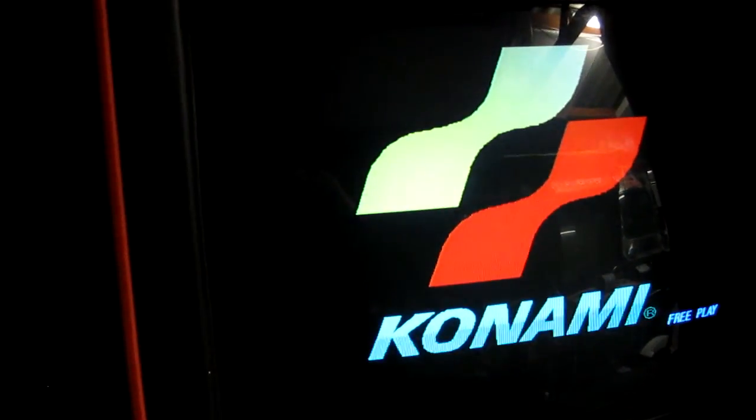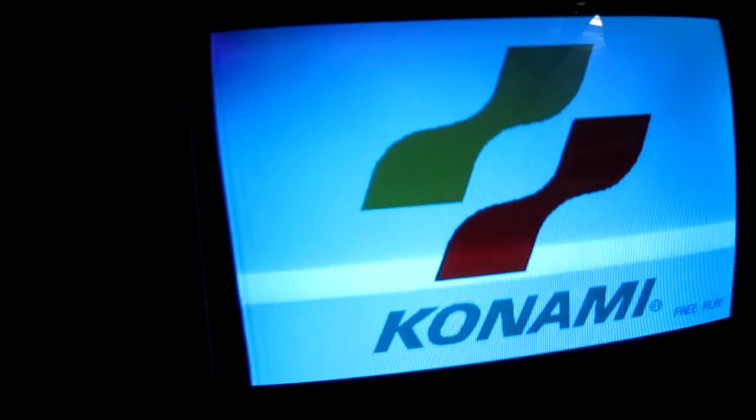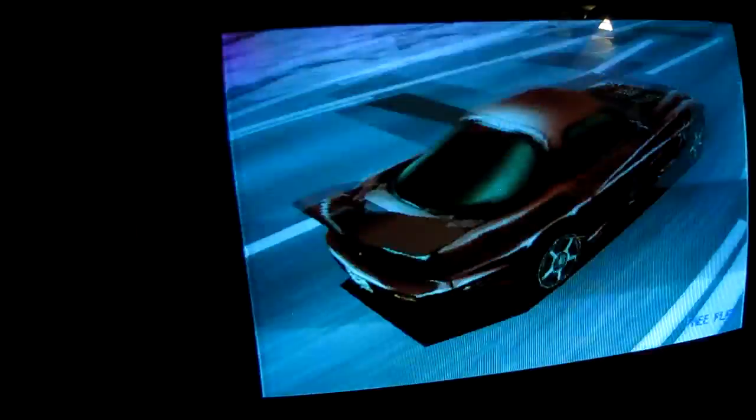Now, I can't say if you can see, but basically it needs degaussing in the top left hand corner, which is quite purple. Another thing you'll see when the screen goes white is, there you go, you see how it changes size when the colour changes. That's kind of indicating poor HV regulation.